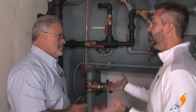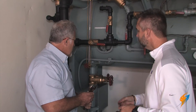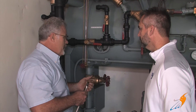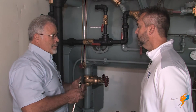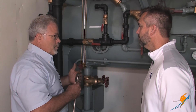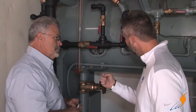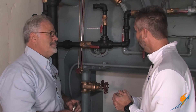When things heat up and it leaks, if you get a little bit of water and heat, you can snug it down a small amount — but you don't want to over-tighten. That is the worst thing you can do because it will put too much stress on the gasket and the gasket will prematurely fail. Once you've got it all tight and there are no leaks, we're good to go.